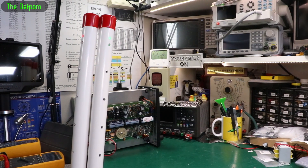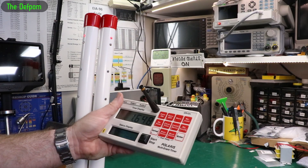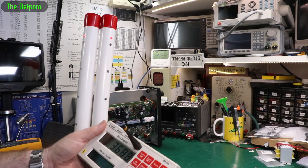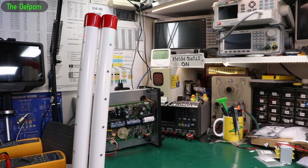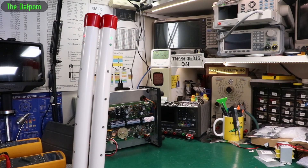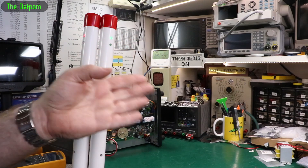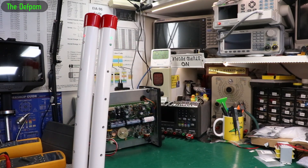That's an interesting discovery. I've used the diagnostics menu before for testing — the secondary menu which shows channels and checks for activity. As we saw, nothing was showing up for the pole that wasn't transmitting according to the console, yet on the spectrum analyzer it was showing up — which is weird. I've seen other light curtains pop up on that menu at events even when they aren't programmed into this system. So I'm really surprised it didn't show up. It must be a programming issue.